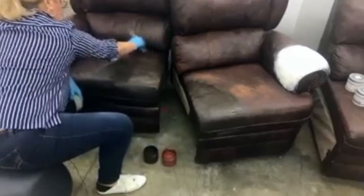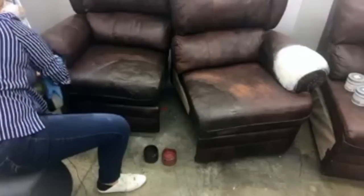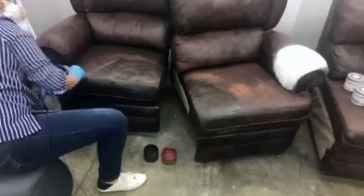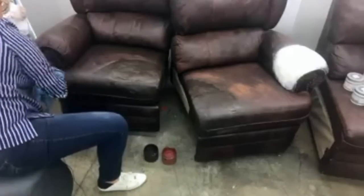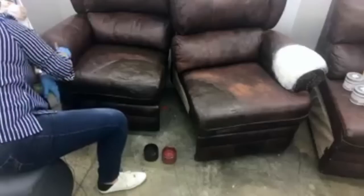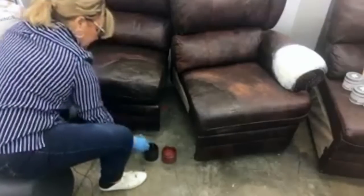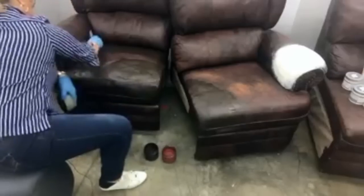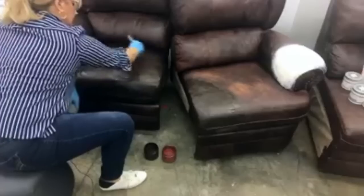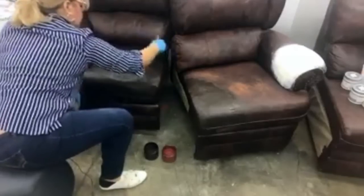Truffle is a pretty decent blend to this — yeah, I think that looks good, it's kind of matching it pretty good. Just going to keep on rolling with it here. I don't want to paint over the pretty nail heads, so I'm going to leave them and keep as much of the original as I can. Let's continue this and put a little red in it, then we'll stipple the whole thing to kind of keep the character of it.